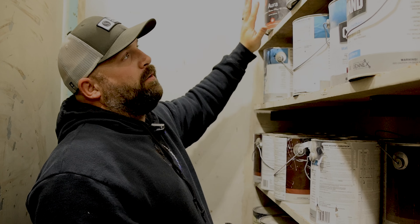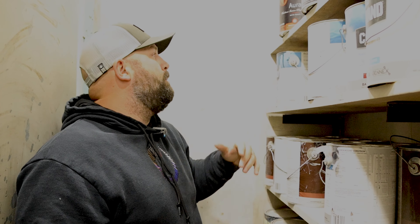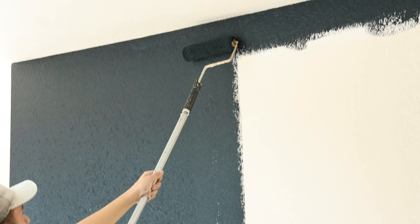I don't think it's worth it for a DIY person. If you're going to go paint your house and go to a Ben Moore store, I would stray from Aura because the dry time is so fast that you're not gonna work fast enough. If you've got five guys trying to paint a room, then absolutely try it. But you're gonna end up with the same results with the Regal or even multi-coats of Ben. It says you only have to one coat it — I'm being perfectly honest — I have never not had to two coat anything. I will always two coat stuff, so it doesn't really matter how much you pay for the paint.